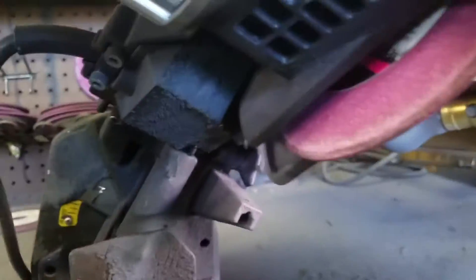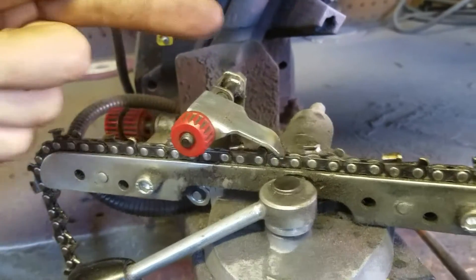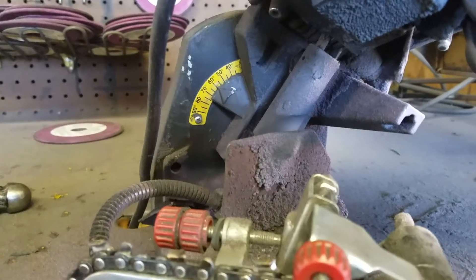Always use eye protection whenever using a machine like this. There are sparks that fly, and you can see all this crap around here — that's all metal dust and wheel dust. So just as a review: this adjusts your forward and back, there's your up and down adjustment, that's your manual lock, we have a hydraulic lock so we don't worry about that, and we set ours at 30 degrees which cuts the tooth at the angle. We set ours at zero for this type of chain — and the tilt is at 60 degrees. So that's 60 degrees tilt, 30 degrees angle, and zero on the side.